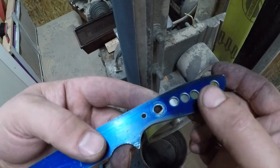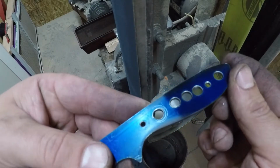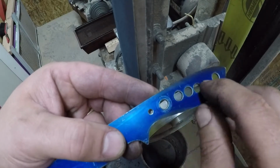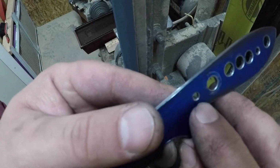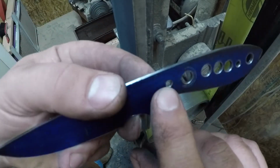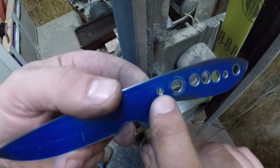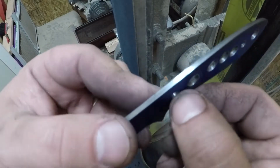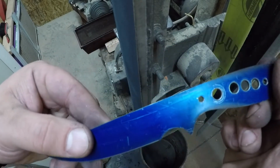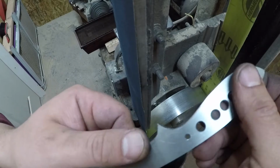And that just lets with that burr, if you have a burr on this side and you don't have a burr on that side, it can kind of sit on the table like that. With the amount of clearance that we have for the pinholes, and after you chamfer them, see how much actual hole is in there, that's 0.127, I believe, diameter. By the time you've got just that little bit of hole, there's still going to be some wiggle room for the pins, and it'll be okay. But anyhow, let's go ahead and deburr the parts here that we can get to.